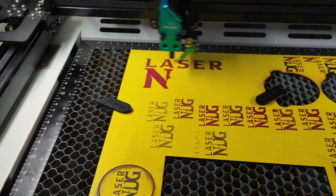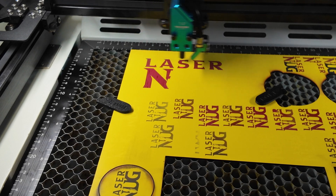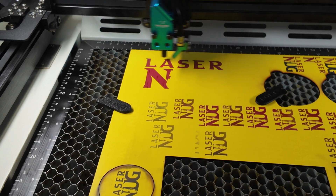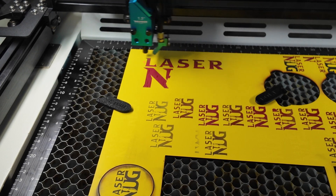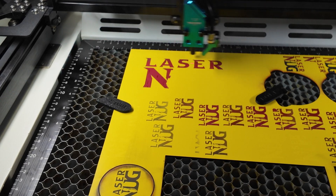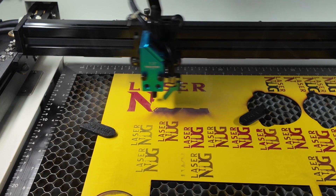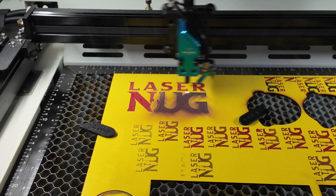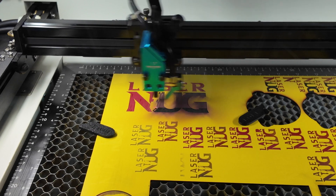You can see I'm running my second pass now on that second layer. I've created settings at a lower power so that it gets most of it off on the first pass, and then it kind of cleans up — as Robert says — on the second pass. Another benefit to not using the crosshatch on this gantry laser is that my engrave time is literally a fraction of what it used to be. Getting down to that third or final layer always causes the most exhaust or debris, but you'll see how quick and easy it is to clean up with a magic eraser. So now it's running its second pass at a different power level — the clean-up.